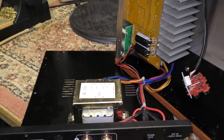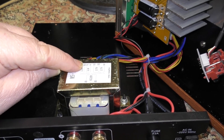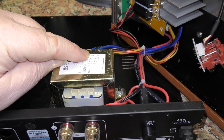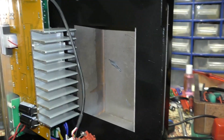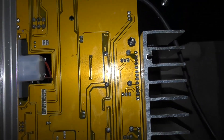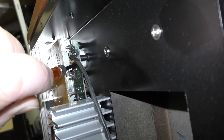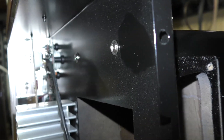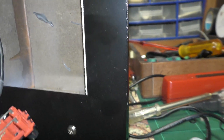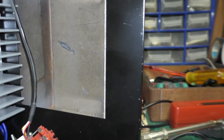Here's what's inside. There's an AC transformer with two 6.3-volt taps and two 17-volt taps - so not much in the way of a B-plus voltage. There's a circuit board and a massive heat sink with a whole bunch of pins soldered onto it, which strongly indicates a solid-state amp. Around the back there's a green circuit board where all the valves are mounted, but I can't see clearly enough to tell whether anything other than the heaters are connected. This MDF enclosure really takes the biscuit.